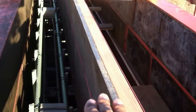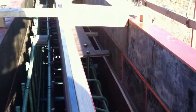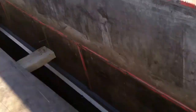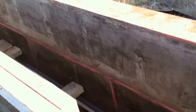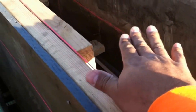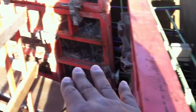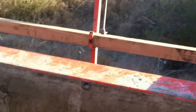The concrete over here will be flat and then the bridge actually sits down. You can see those bolts are going to accept our bridge. This is a nice template they have over here — you can see that's our bridge template. Our bridge is actually going to set here. This project calls for two rail cars side-by-side. One rail car is set here; the top of the rail car should be flush with the top of this right here. So when you drive on this concrete, the roadway will be way over there — they've got to build all this up. The roadway will come here, then this is just a little bit of concrete, and then the bridge deck starts right over here and goes all the way out that way.